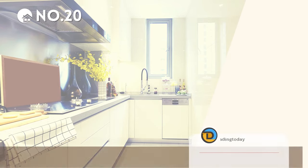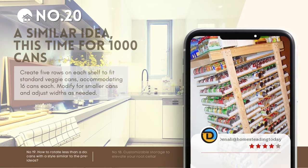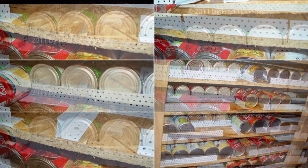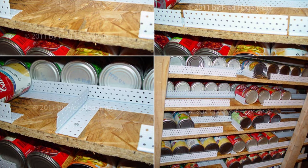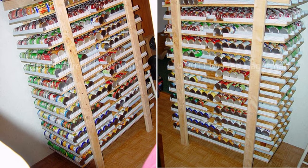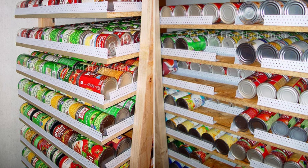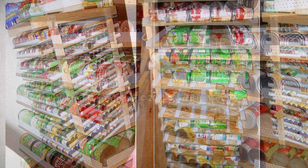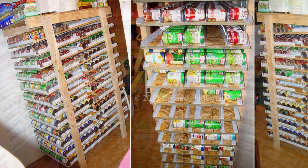Number 20: A similar idea, this time for 1,000 cans. Craft 5 rows per shelf for standard veggie cans, each fitting 16 cans. Adapt with smaller cans and adjust widths for varied sizes. Use removable gates for diverse stock and reinforce with cross-members or L brackets. No table saw? Opt for a circular saw or router with a 5/8 flat-bottom bit. Insert a one-time cut between shelves to maintain 2x4 strength. And if you're eyeing those inventory photos — yep, you're a dedicated prepper.